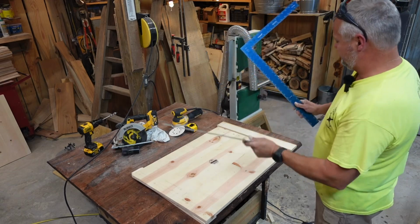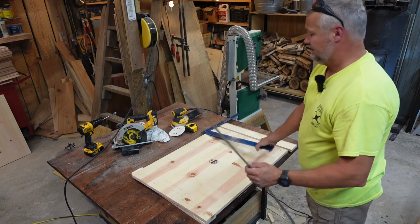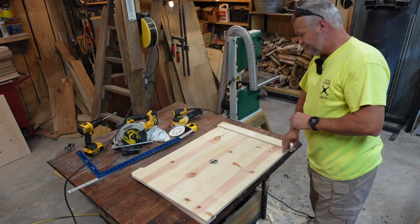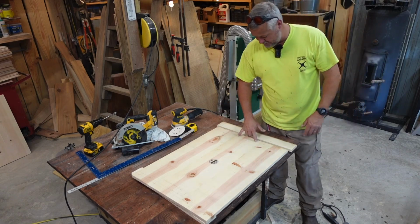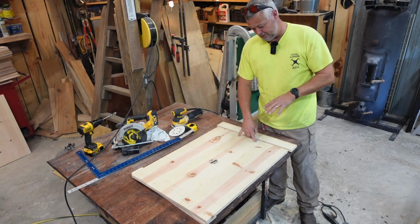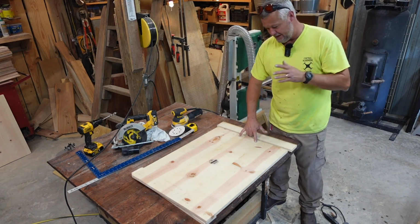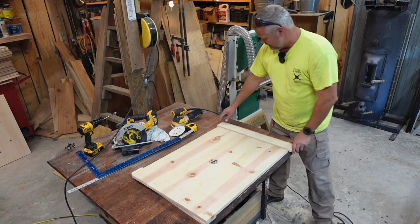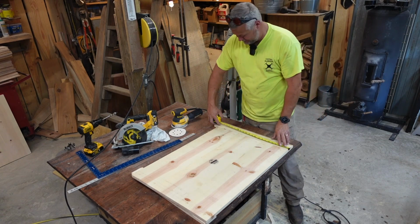I use my 2 straight edges here to get me an inch or so in here, and 2 inches in there. That's just my measurements I use because those are usually laying around to where I can get to them. And I put my screws down through here. And because I'm trying to talk and work at the same time, I messed up, but these 2 screw holes should not be here until I get to the phase of putting the handles on. Because these holes are gonna be really close to where the handles are gonna go, and in my more recent designs, I quit putting those in until the end because I kept messing that up. And I've marked this board here just to be safe. I always just leave these guys short until I get done.